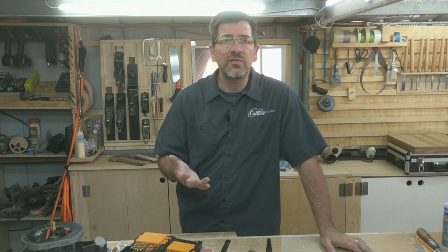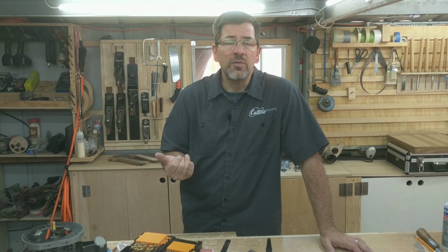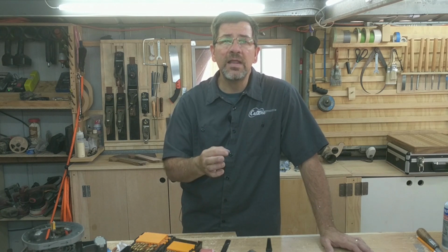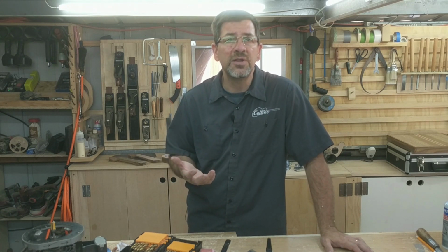So it looks like our next step really is to start doing some final sanding. I don't want to put frets on until I've got the fretboards sanded, and the installation of pickups and wiring, like all of the recesses are cut. So it really is time just to start installing those things once that final sand is done. So I'm going to start working on that, and then I'll probably drill holes for tuners in the headstock and that sort of thing. And so we should be then, after a million hours of hand sanding, ready for final installation and wiring up, as well as finish, and we'll talk about what kind of finish we're going to put on when we get to that point.